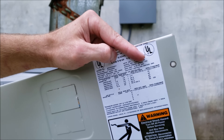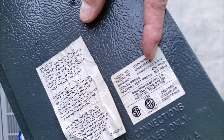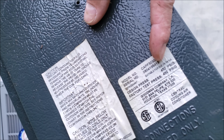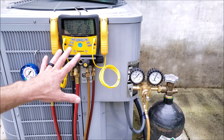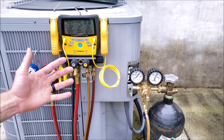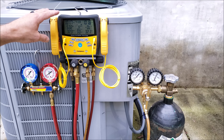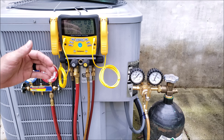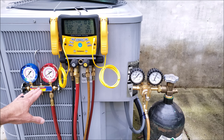Right below my finger you'll see the max design pressure is 150 PSIG on this evaporator coil. Here's another coil listed at 450 PSIG. Even on a new system with a max design pressure of 450 PSIG, I would still pressure test it around 325 to 350 PSI — you could go up to 400, but you don't typically need to. If you're checking with a digital manifold gauge set, you should still be able to find the leak. A compound set may only read up to 350 PSI, so on that type you may want to stay at 325 unless you have a heat pump manifold gauge set.